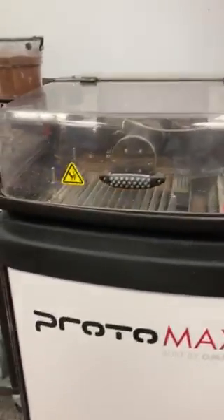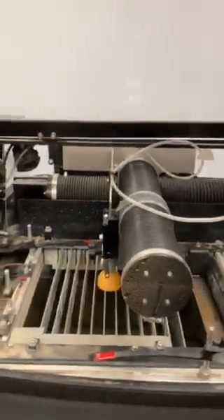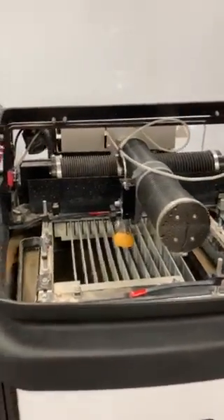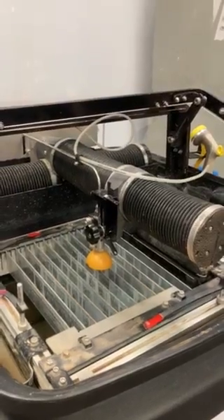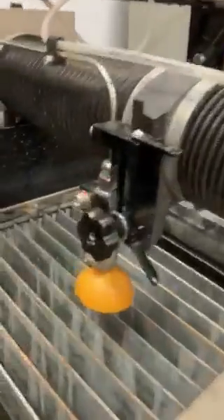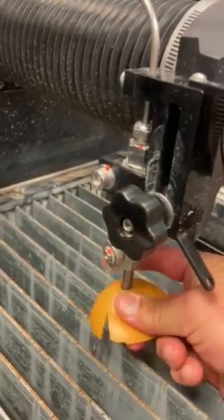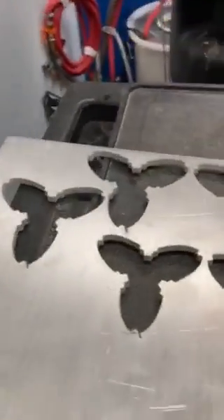Although it's a water jet, it actually is the strongest, most powerful option that we have available to us at this time. People tend to be a little bit deceived by the idea of water being so powerful. But when you're able to pump it through a nozzle refined to essentially the tip of a needle at 40,000 PSI, you actually can cut through aluminum.